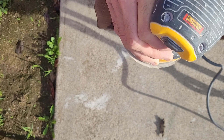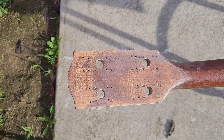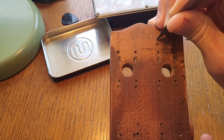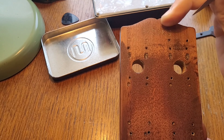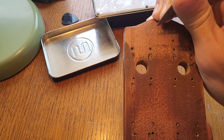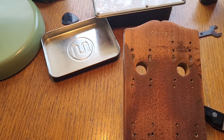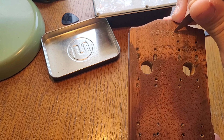We tried chipping away with a knife first — didn't work. Too many layers of clear coat, some bonding, some not; you couldn't really see what you were getting at. Since the back of the headstock needed to be planed anyway — whoever sanded it before created a lot of valleys while dodging the serial — I went ahead and used an orbital with some worn-out 220 and jabbed at it lightly. I'd hit the area around the serial briefly to heat up the material, and almost instantly the layers of clear coat just chipped and fell away.